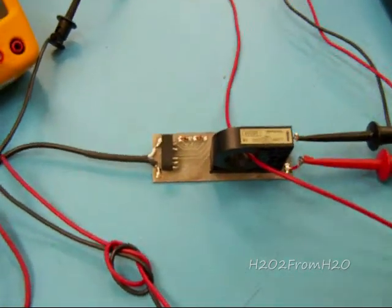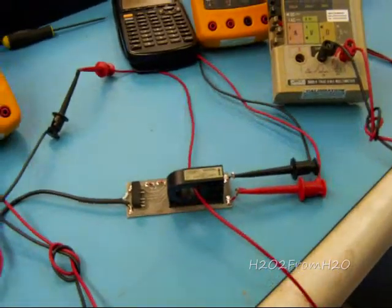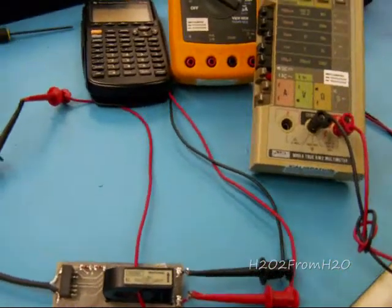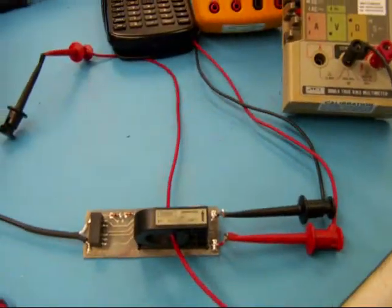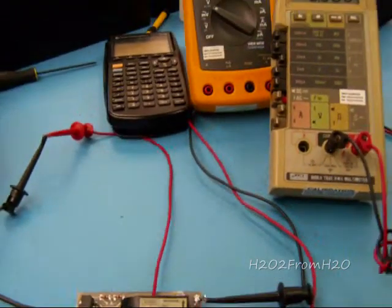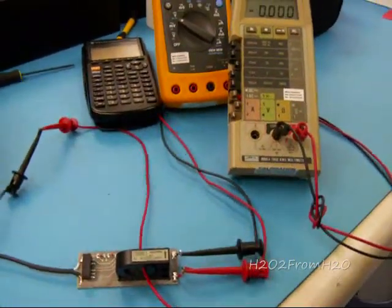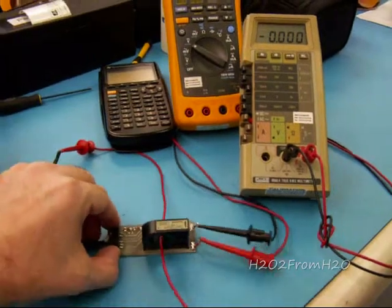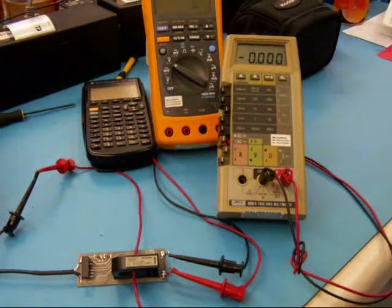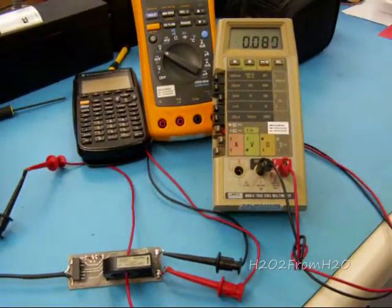Thank you Chuck. You're welcome. The next thing I'm going to show you is that the position of your wire in any Hall Effect sensor is not critical. Some people have mentioned in YouTube videos that they're worried about how accurate it is. So I'm going to demonstrate that to give you a better feel for the fact that the wire moving around isn't really going to affect it. I'm going to turn my pumps back on and keep an eye on this meter as I move that wire.